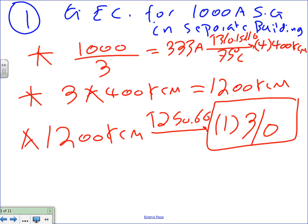What do you mean covered? Insulated is easy, fully insulated. Covered is somewhere between bare, basically it's not voltage rated. They put a non-conductive cover on them, but they're not tested for voltage insulation. You have to have a certain thickness of insulation to be called insulation. Covered is protected from the elements. It's not meant for you to grab into it.